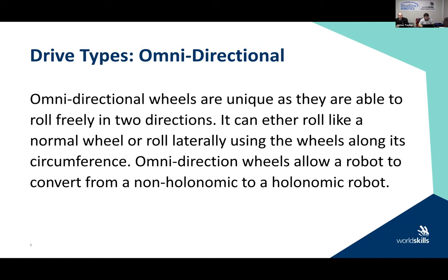One of the reasons that we upgraded your omnidirectional wheels to the two-piece wheel and changed the durometer on the little rollers was so that we could match the same grip that we would get from the standard 4-inch wheel we gave you. We did a little bit of testing of the old wheels and the new wheels, and we found that under load, we are getting the same coefficient of friction with our Omni wheel working just like a normal wheel that we did with our previous regular 4-inch wheels.